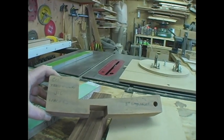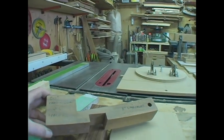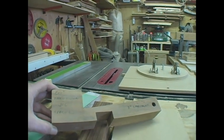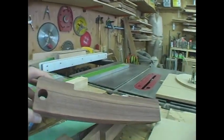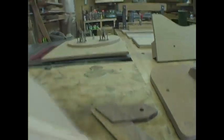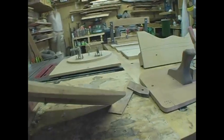This jig is for making seven-degree tapers for the spacer piece on a takedown limb. It's very easy to make — just a typical angled jig. You make your cut on the table saw, then go to the thickness sander and run it through to make it super smooth and glue-surface ready. This one here has a shallower angle for a different limb, and this piece is also made at a seven-degree taper — for whenever you want to sand pieces through a thickness sander.